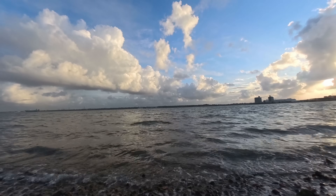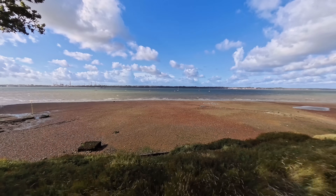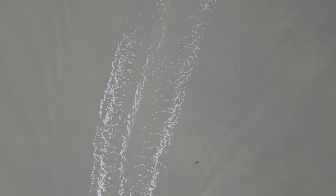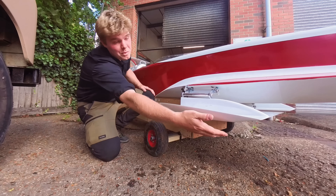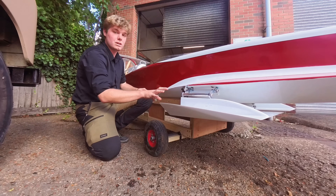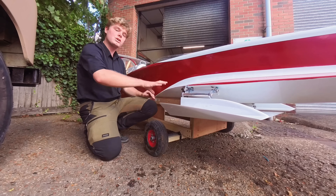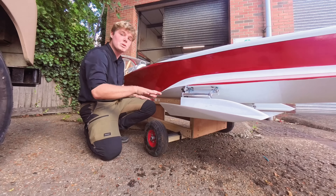The reason it's hard to go fast on water is because it has waves on it — it would be so much easier if it didn't, but there's nothing we can do about that. Obviously a boat like mine is designed to only go out in very calm conditions, but you can never count on perfectly still water, so I've put suspension on it. It's a bit like a car: when a wave hits the front planing surfaces, instead of tipping the entire boat up and down, it compresses a shock absorber. This system adds a lot of aerodynamic drag, so I've kept it to the front planing surfaces only where it's most important. But this, in conjunction with the inherent aerodynamic stability of the boat, should help it stay stable and planted at speed.